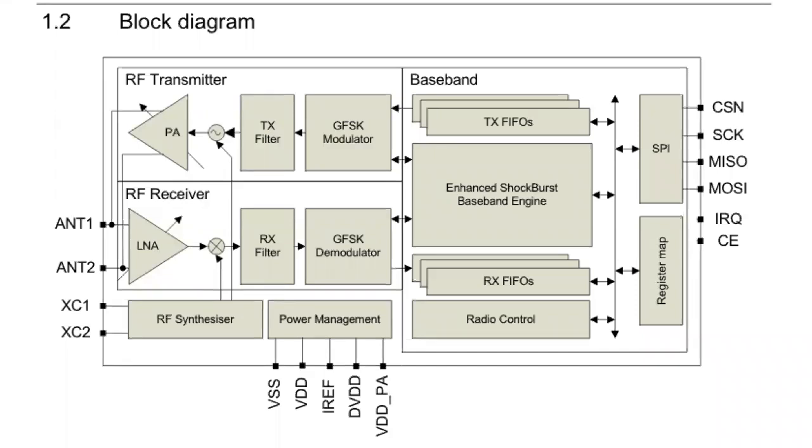So in the world of modulation, there's a couple of basic terms. I'll say there's two kinds of modulation in the analog world, baseband modulation and broadband modulation. In baseband modulation, what you do is you take a signal like zero and you assert a voltage like ground. And you take a signal like one and you assert another voltage like 5 volts. That's baseband